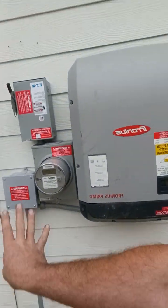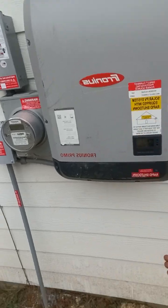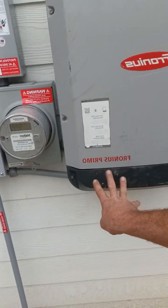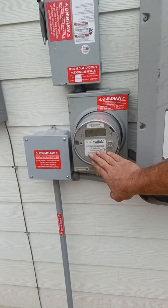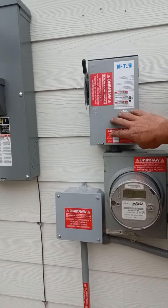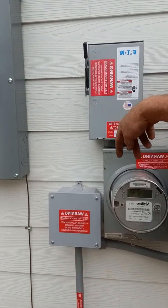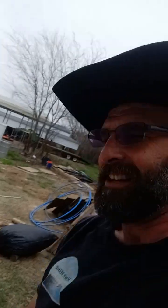How this is wired up: the DC wiring comes into the main junction box, then gets brought over to the actual inverter for all of its DC inputs, which includes the main switch at the bottom for the rapid shutdown. Then the AC line comes out and goes to the bottom part of the meter. The top end power is coming in from the junction box, and the main incoming power from the meter itself goes into the top-end leg of this panel; outgoing power goes into the top-end leg as well, and so forth.